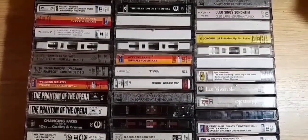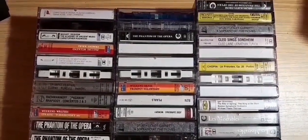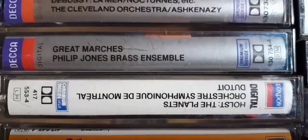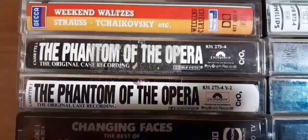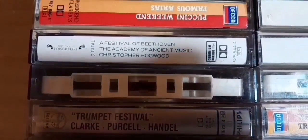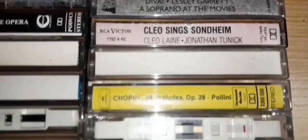The biggest advantage of metal type 4 cassettes is they can be driven harder, meaning you can record on them louder than on any other cassette type. Another factor is generally Japanese decks are not optimized to use chromium dioxide cassettes, but their own type 2 cassettes. And this came down to licensing issues.